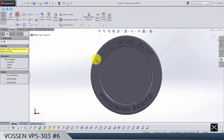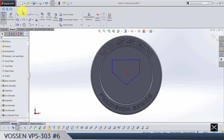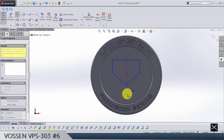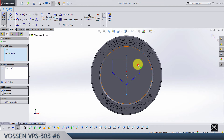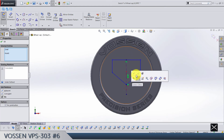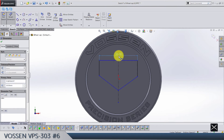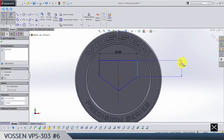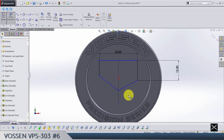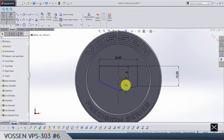Start off with one sketch shaped like this — five points — and add one center line. Make the center line coincident with the origin. This point is going to be midpoint with this line, and this point coincident with the center line. The length of this line is 26.5, this one is 12.5. From origin to this line we have 8, and from origin to this point we have 13.5.